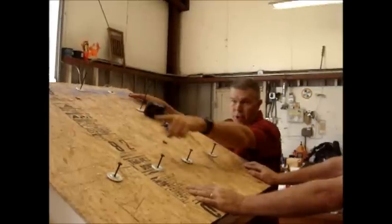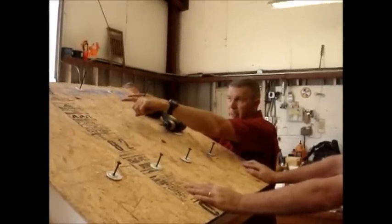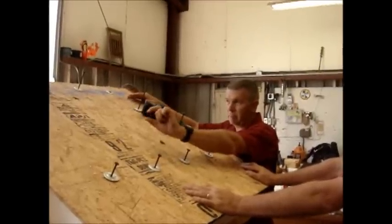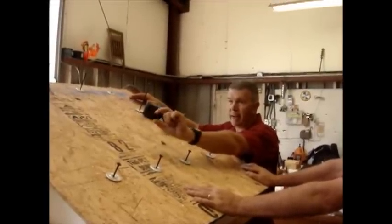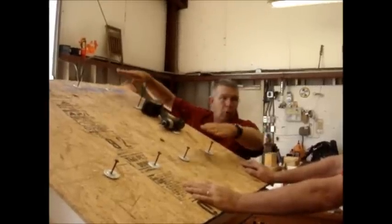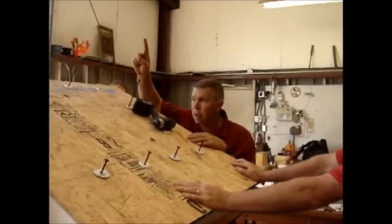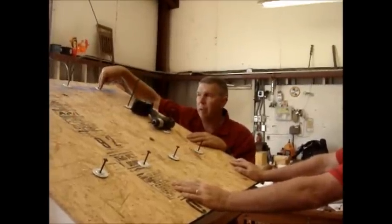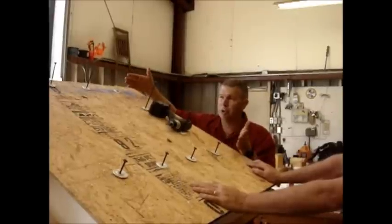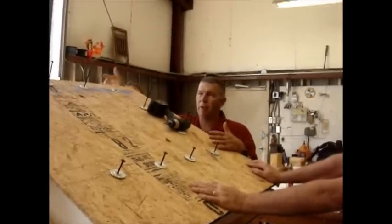Make sure that the panels are flush top and bottom — we want a nice flush straight line on top and bottom. Nail up your spline joint, keep that completely fastened together, and then if we need to take the entire plane and pivot it up or down, we can do it with the ratchet strap, with the crane still hooked, and with this as our pivot point. And now you can adjust your entire roof plane so that you are in line with the ridge.